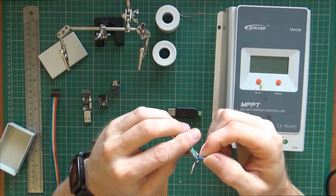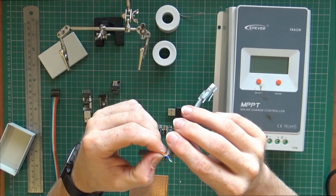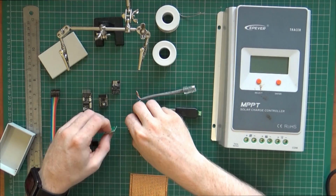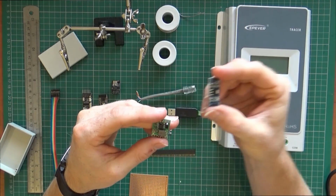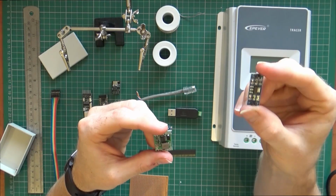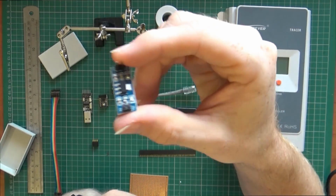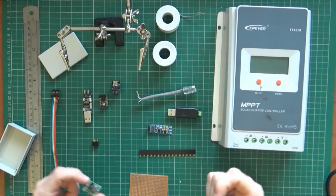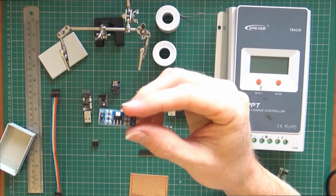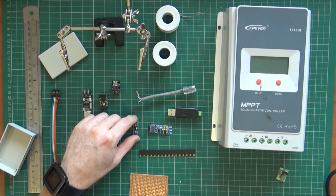But the great thing is, in the manual it states it's 7.5 volts, but in reality, when I tested it with my multimeter, it was just shy of 5 volts, which is okay. So I've got two options for the power. For the 8266, I can either step this down to 3.3 using a pre-done little board, or I've got an adjustable board. I think because of the current draw, I'll probably just use one of these pre-done ones. It's cheating, you know. You could design something a lot more bespoke, but these things are ridiculously cheap. Buy them in bulk. So that'll drop down the power.